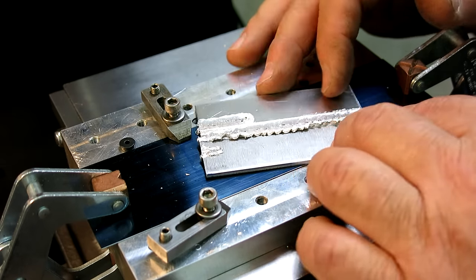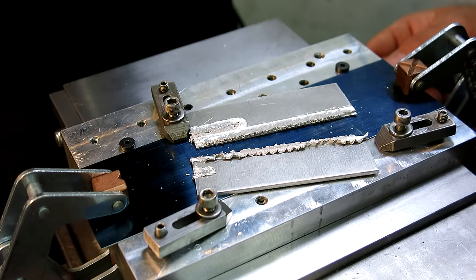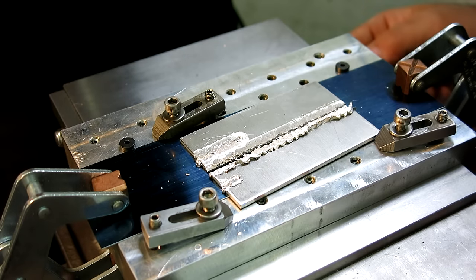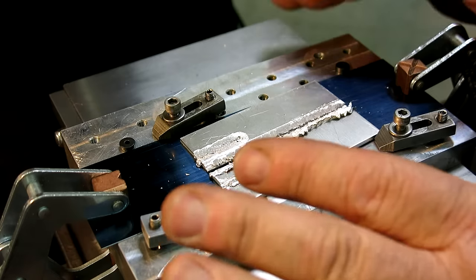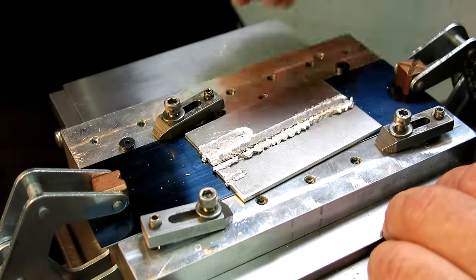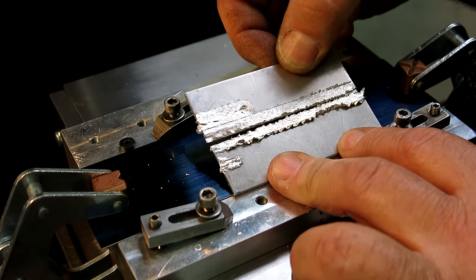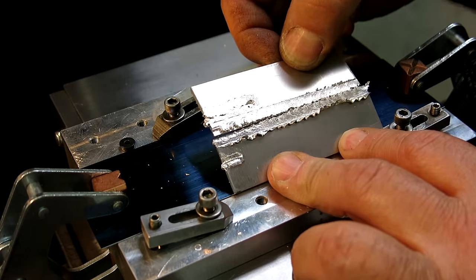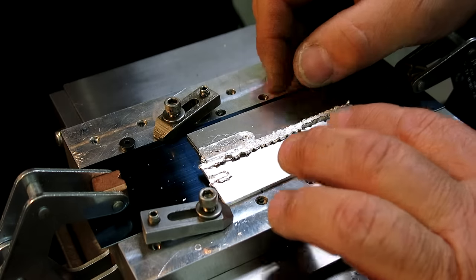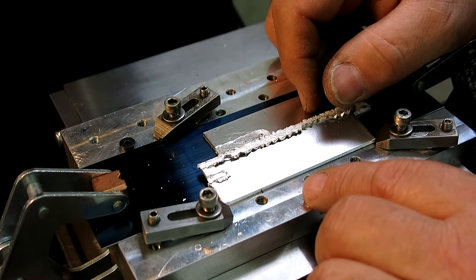I don't see anything exciting on the back. Oh — I wouldn't have guessed that looking at it. I mean, that's an awful looking weld, but I can't break that with my hands. There it goes — look at that. It's pretty strong. I'd say we got more than half the material penetration there. That's pretty bizarre. I wonder if I had the right thickness material for this particular tool and how it would behave for a full penetration weld — I'll have to get some one-sixteenth material. You're probably not supposed to get this crud on the top, and it seems like that would thin the material. The forces are quite high. I'll have to talk to my anonymous viewer and see what he has to say about my little demonstration here. I totally don't know what I'm doing with friction stir welding — full disclosure. It's an experiment and I'm having fun. Hope you guys liked it, thanks for watching — if you like this kind of crazy stuff throw a comment up and don't forget to click the subscribe button.